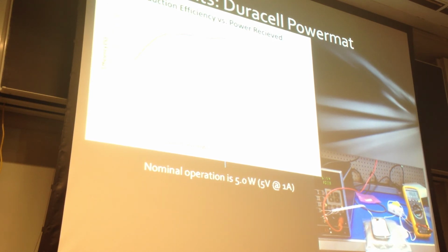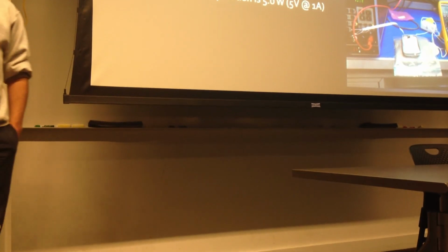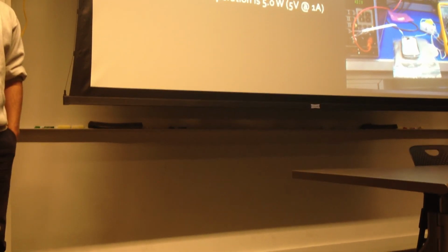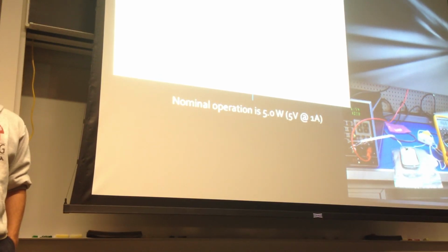Okay. Others? So what if the end of your tether is spinning wildly, like you can't really approach it from one side or from the correct side? We didn't observe any spinning. Part of that could have been because we were attaching power cables from the side, which maybe kept it in one orientation. But in the case where you do accidentally approach from the south side, and you do encounter the peak of the cam profile, you could always back out and try again. And statistically, if you do that 2 or 3 times in a row, your odds of hitting that every single time are very small.